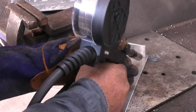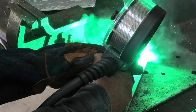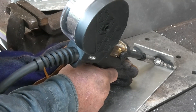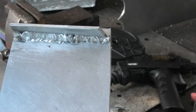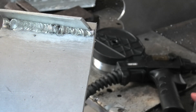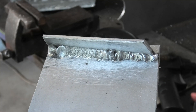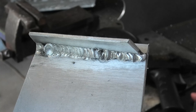Welding here, I can tell as I'm doing it that the wire speed is too slow, and I'm going to have to adjust it. I've now increased the wire speed a little bit and I'm going to have another go. This is how critical the settings are — this lumpy section was done on 18 volts with a wire speed of 4.8, and this better section here was still on 18 volts but with the wire speed turned up to 5.3. There's a huge difference in quality. Learning how to use this welder and spool gun combination is fairly critical — take your time to learn what you're doing with it.